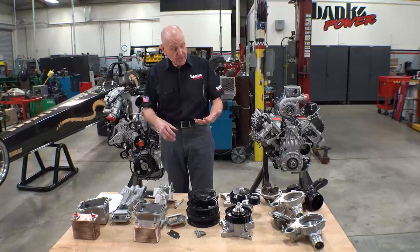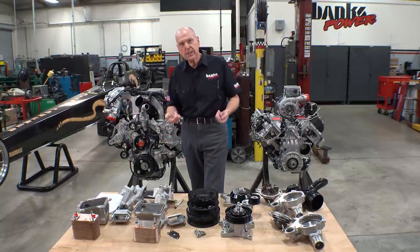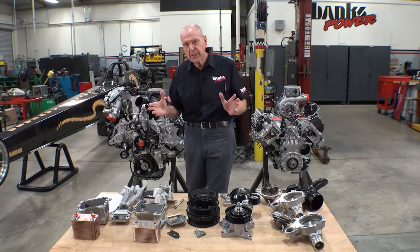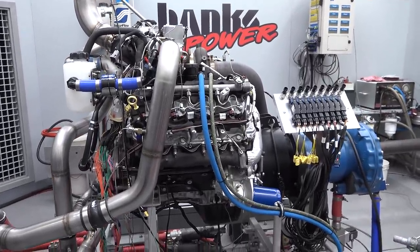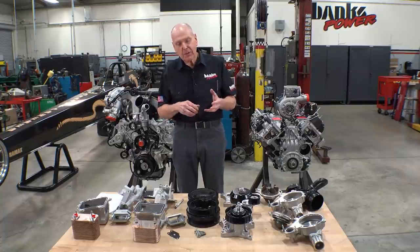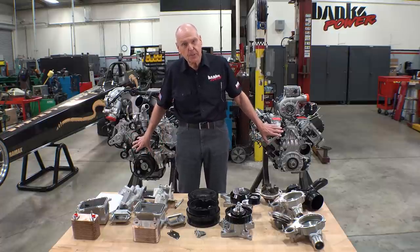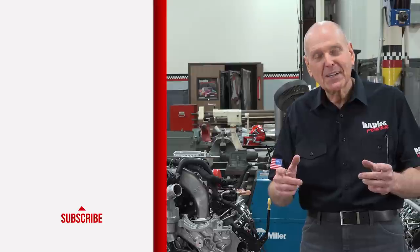Basically, what I want to do is find their limit. And by the way, you've got more oil cooler, you also have bigger piston cooling nozzles. So I think we're going to have to push real hard to find the limits of the pistons, the block, the crankshaft, the rods — but we're not going to starve it for oil, we're going to keep the oil cool, we are going to rev it a little high. We're not going to starve it for jacket cooling. If I have to add a second water pump belt driven, I'm going to do it. If I have to add a second oil pump belt driven, I'm going to do that. That's all going to be in the dyno series that's upcoming, so stay tuned. We're going to have a lot of fun with Duramax's this year. I suggest you subscribe. Thank you.